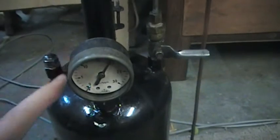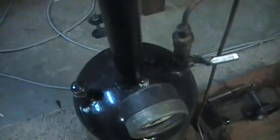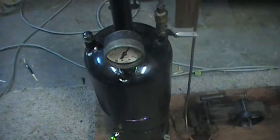Still got the same gadgets on top — gauge, safety valve — and the safety valve still works fine. And essential flues here. These are essential in a fire tube boiler because they increase the surface area and they make it boil water really fast. From cold it only takes about 10 minutes to boil about a litre or two.